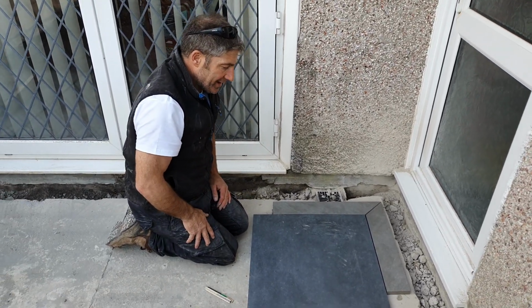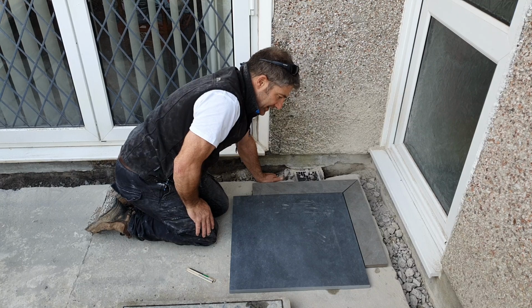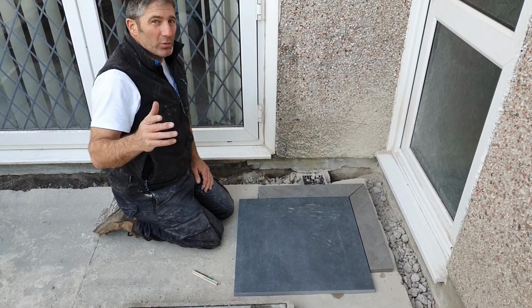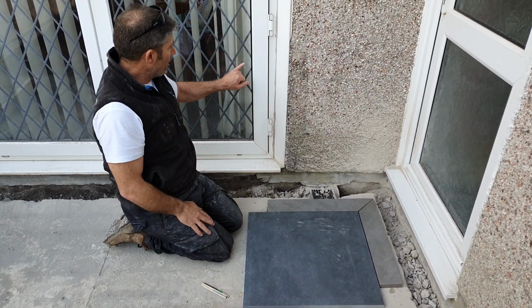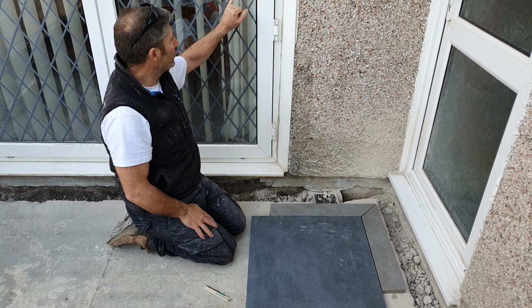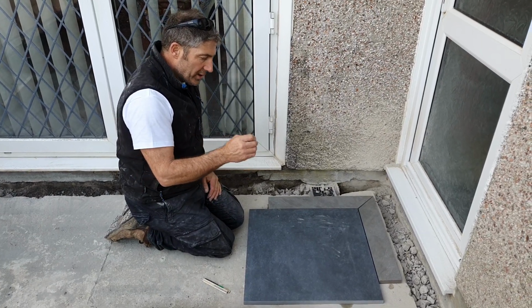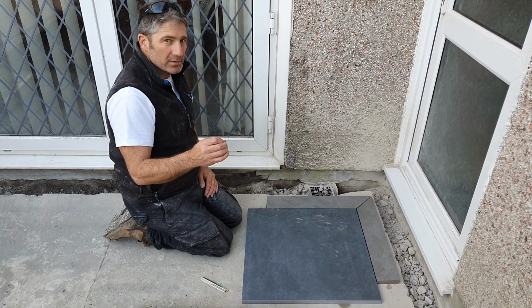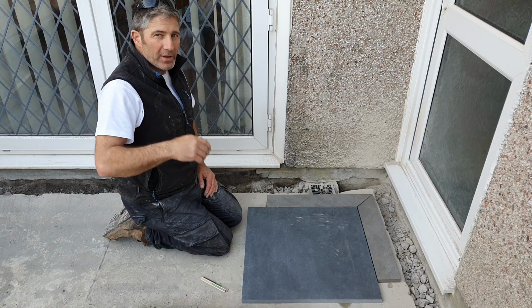The other thing you've got to take in consideration, people always believe that porcelain is low maintenance, and yes it is, but the surface of any porcelain product, remembering there are many different types of porcelain, and we can talk about that again in the future, is no different than glass. Glass has micropores, and those micropores get dirty the same as the porcelain. But my concern, when you finish your patio, you've laid it and grouted it and used a cementitious grout, is the likelihood that that grout is going to go green at some time, simply because of the country that we live in.